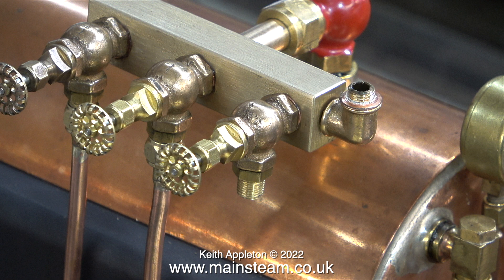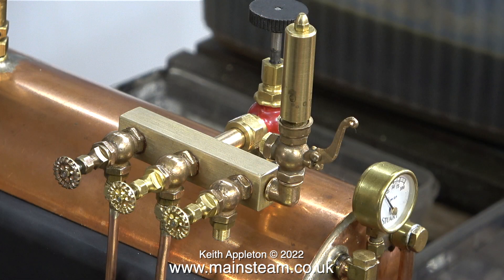I'm going to fit it temporarily back onto the turret. I'm not using any Loctite 542 because it's going to be removed, but it's a good place to keep it so I don't lose it. When I look at the turret assembly now I must admit it does look a lot better.